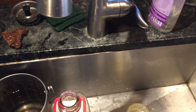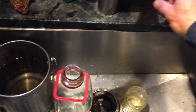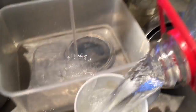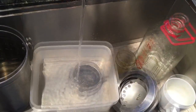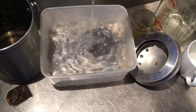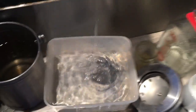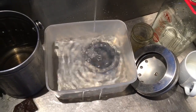Up at the sink, we'll see how much usable water we have. You probably do what I just did pumping-wise in about half a minute to a minute. It slows down quickly below about 15 to 20 PSI — it just goes right down. So that's about a gallon, and this was half a gallon — we had about a gallon and a half at 15 pumps. That's a fast shower. If your wife or husband wanted a longer shower, you could go down and take turns — one of you pumping five to ten times every half minute or so.